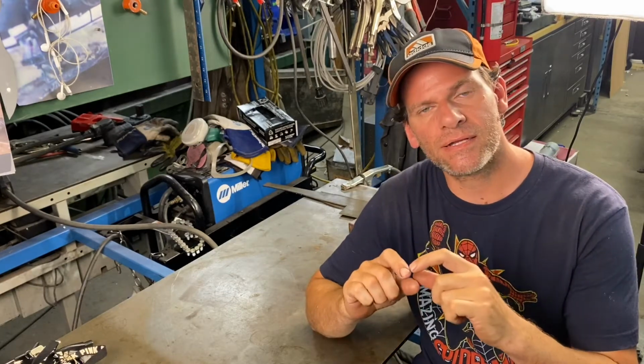So now the billet is forged down, we pre-machined it, and now we're gonna put it on our surface grinder and grind the thickness very accurately. And then we're gonna do a little pre-etch, and what I'm gonna do is I need to make that cutout in the center of that blade to accommodate the plane.